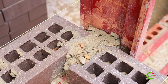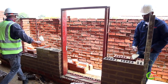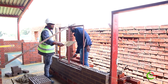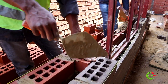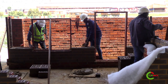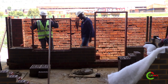Your window frame — you don't build it in immediately because it needs to match the level of the door frame. First you can build maybe four or five courses and then lift and plumb your window. Here we're opening up the space for our window frame. This is how the three-quarter ties in on the outer skin. Once you've built your three courses, your window comes to the center. To center your window, use your steel tape to make sure you have equal measurements on both sides — for example, if you measure 100 millimeters on one side, it needs to be 100 millimeters on the other side — so the window is straight and plumb.